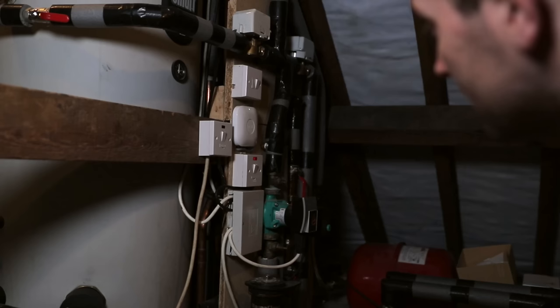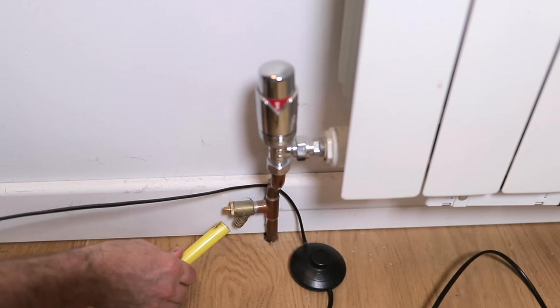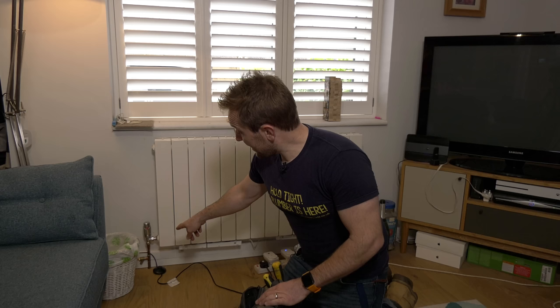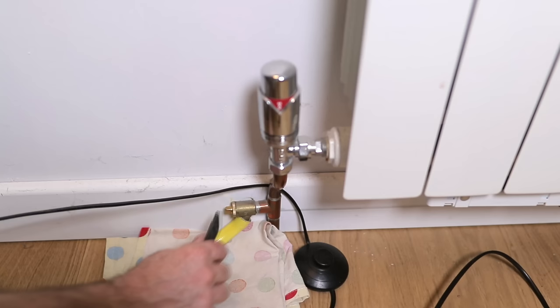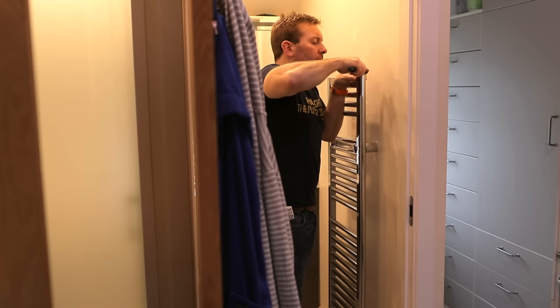Here's a little checklist. Number one: make sure the boiler is turned off, the pump is turned off, and the heating system is electrically isolated — usually there's a switch next to the time clock. You can switch the boiler off on the front and pull the lead out of the bottom of your pump or just leave it between speeds. Next, make sure the two-port and three-port valves are latched open. Then attach a hose to the lowest drain point, open it up, and open all radiator vents from the top floor down, allowing air into the system. Once water stops flowing, you're ready for the next bit.